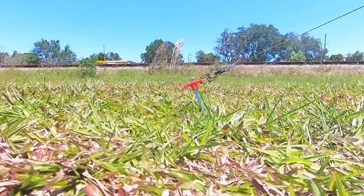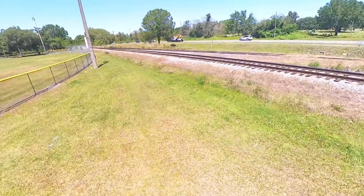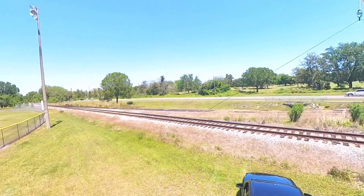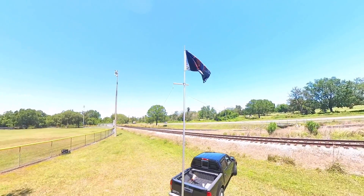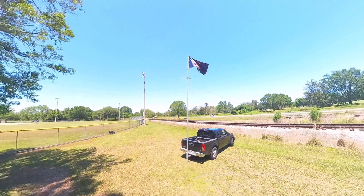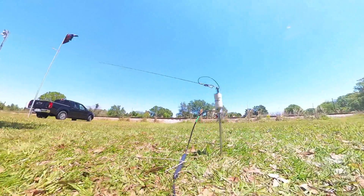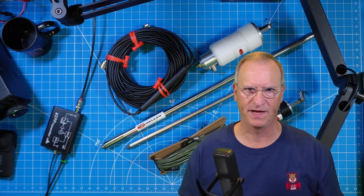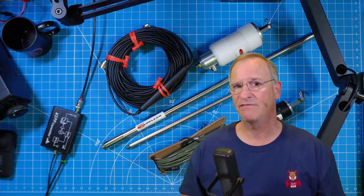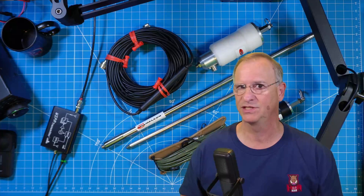Take the polymer ring on the far end of the wire and attach it to the ground with the ground stake. Take the floating ring in the middle of the wire and hang it about 20 feet in the air. The balance of the wire goes down to your micro or mini. This inverted V is a short to medium range HF antenna providing NVIS below 10 MHz. It's bi-directional broadside to the antenna above 10 MHz and omnidirectional below 10 MHz. I was doing a number of antenna setups in preparation for this series, so I didn't have time to get an SWR reading on that 60-foot inverted V.